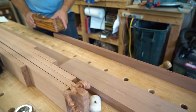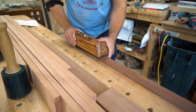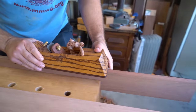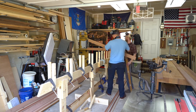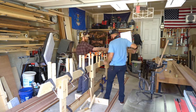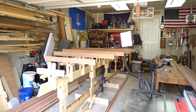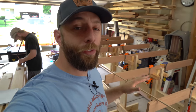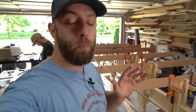It's also fun to break out some unique tools. This is a hand plane that I made about a year ago — there's a video for that if you're interested — and it takes beautiful shavings. I'm edge joining and smoothing up the saw marks on the edges of those boards. Next we're taking a nice long level and a bunch of clamps to clamp each board so that it is nice and level on the strong back.